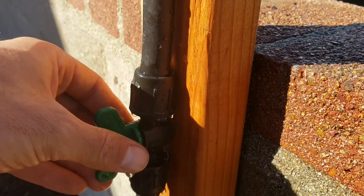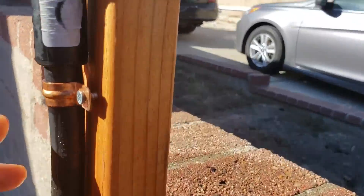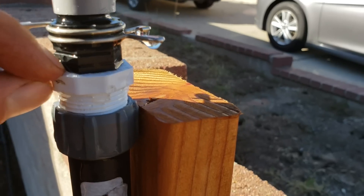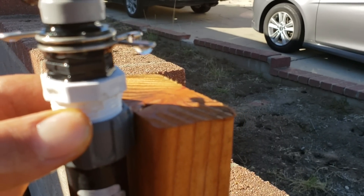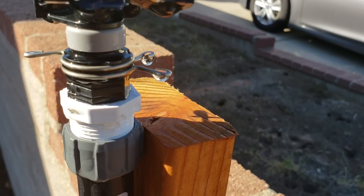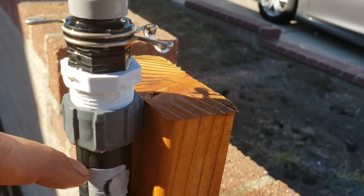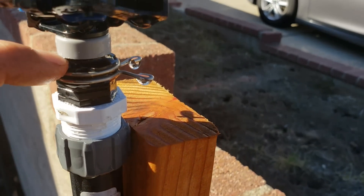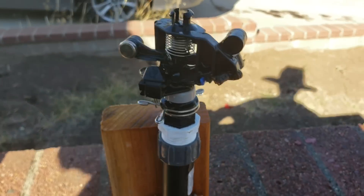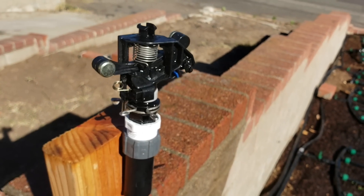As we come up here, it's a half-inch compression to three-quarter-inch pipe threaded fitting — the outer diameter is threaded in three-quarter-inch pipe thread, and the inner diameter is threaded in half-inch pipe thread. I've got plumber's tape on the inside to help it be more watertight, and it has a washer so it is watertight. Then this is just a Rain Bird cheap plastic sprinkler — they spray about 40 feet under full pressure, but with all of them running at the same time on half inch, I'm getting about 30 to 35 feet.